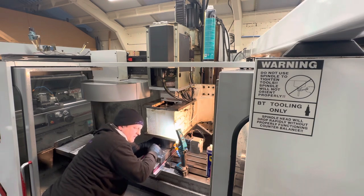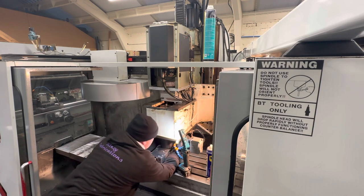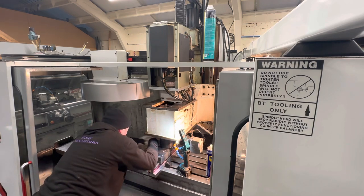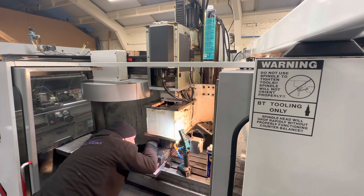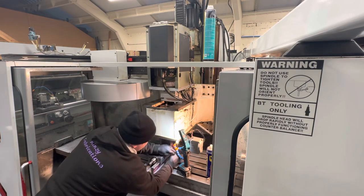I think I was within pretty much give or take 0.02 millimeters when I did the table sweep before. Now I'm going to make sure I've at least got a decent amount of thread in the cap heads, because you don't want to start lifting it up to find out you're only on half a thread and it's going to fall out.